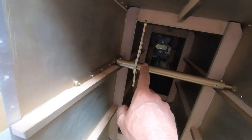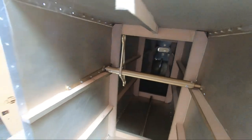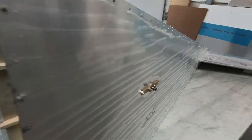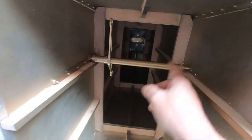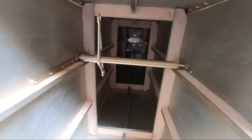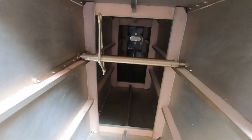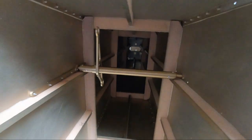I was also able to alodine and rivet all of the parts onto this bell crank assembly, and on the outside I was able to finish putting the bearing inside the upper mount. I've got it all in here and it fits perfectly. I was a little concerned about the length of this tube — it's supposed to be 248 millimeters long. I cut it off at 260 and worked my way back from there, double-checked the length, and it ended up being exactly 248 millimeters — a perfect fit.